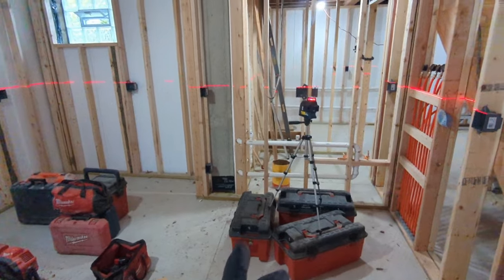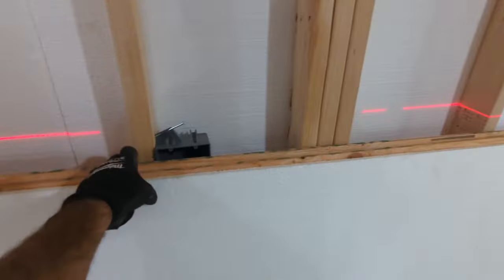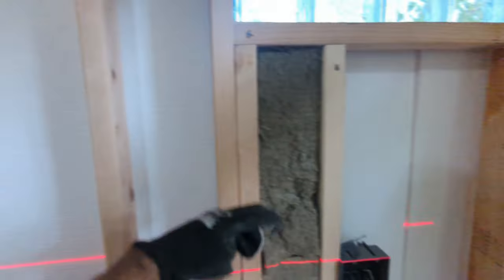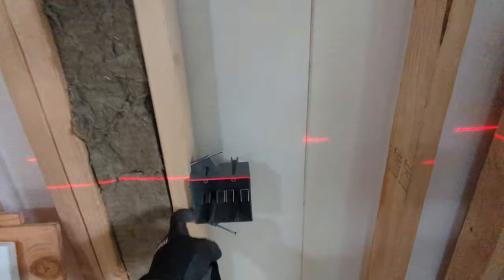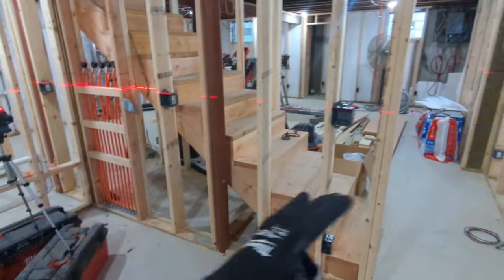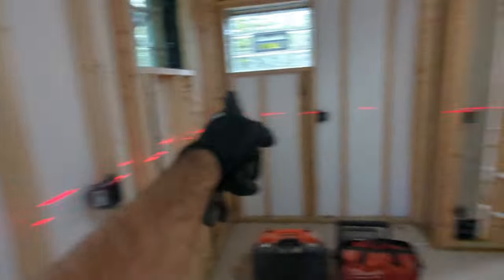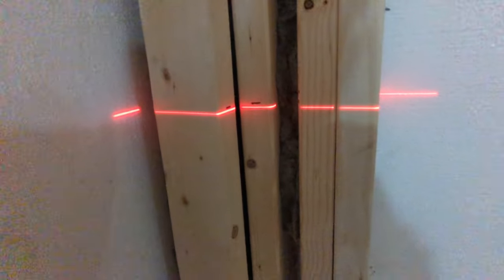This has been irritating, but again, once I got it to 48 inches, that'll mean that we can set all of our sheets against the wall, a quick trace and a notch, and then we can rip all my drywall sheets from there to the ceiling. It's going to be a smaller dimension, and then they'll just set on there. So you only got to do notching for these taller things. They're all set to the laser, but maybe the floor comes and goes. So I checked that too in this room and all around. I went to 48 inches with a tape from the floor and made marks in the corners, which you can see. We're all within tolerance.